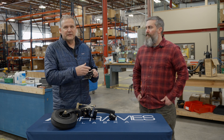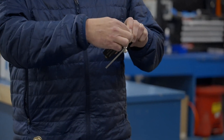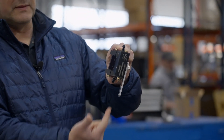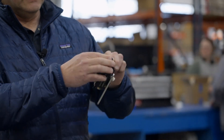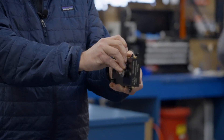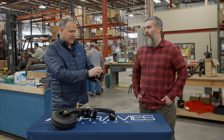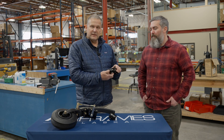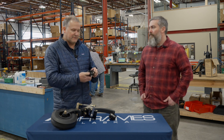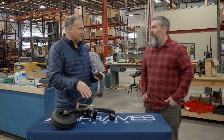It's just a seal and we'll bleed it for you. But if you do want to bleed it, basically use gravity — open these ports on both ends, hold it vertically in the center, and push fluid from the bottom out until you get no air bubbles. When it's all done, you want some resistance right in the center but easy at the ends. This is a rotary dampener; nose wheel aircraft have linear dampeners. The goal here is just to have resistance right at the center point — we don't want to add any pilot load on the pedals anywhere else.